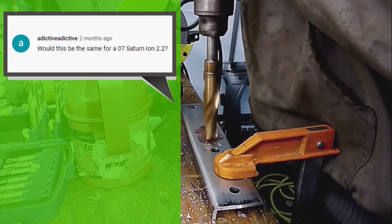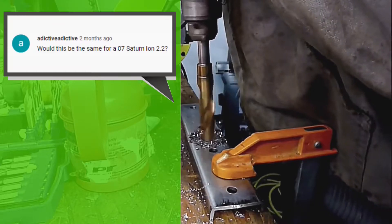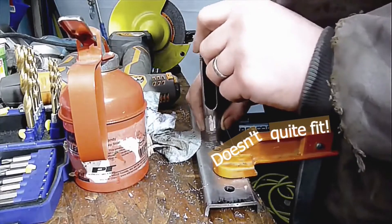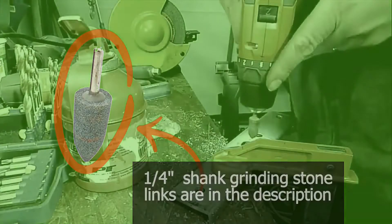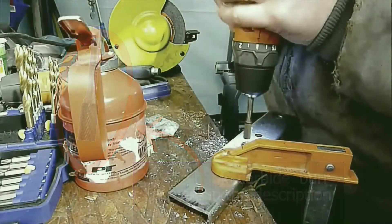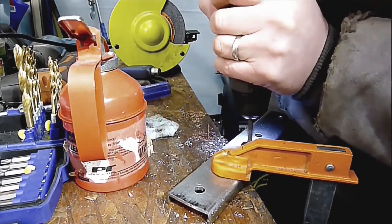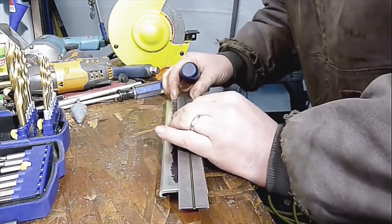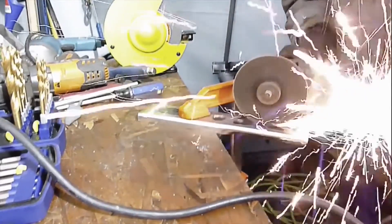The four holes for the slots I drilled out to three-eighths of an inch, and the center hole is drilled out to three-quarters of an inch. But three-quarters of an inch was just a little too small — the pipe didn't fit. I started off with a grinding stone to try to enlarge the hole a little bit, but I ended up using a burr instead because the grinding stone wasn't taking off enough material fast enough. Grinding stones are good if you only need to remove a little bit of material, but burrs are a lot faster — they really eat it up, though they are harder to control. There are links in the description if you want to check them out. I find that using a Sharpie and a scratch-all is a really accurate way to make marks on shiny metal and it's easy to see.